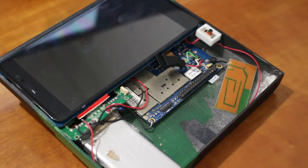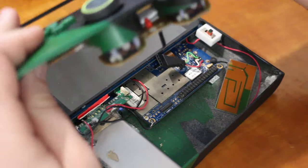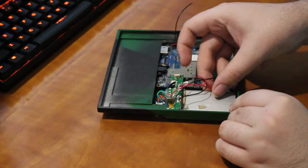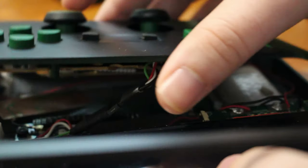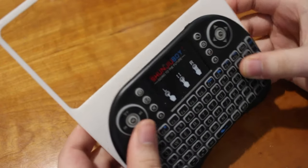With assembly, I've taken special care to not fall into my pattern of gluing everything together. Things break, especially DIY projects, so make sure you have a way to fix them. I'm using double-sided tape to stick my screen down — it's strong enough to keep it from falling off, but also removable with some alcohol if I need to replace the screen in the future. Same with the battery. I pretty much soldered everything together except for the USB gamepad. I built a connector for this because the PCB is mounted in the top of the case, and that's what needs to be unplugged whenever the device is open. This also gives me the option to design different faceplates with different USB devices in them.